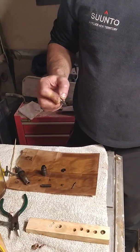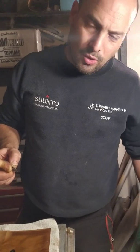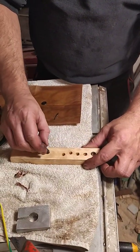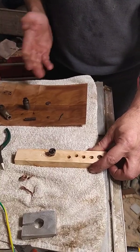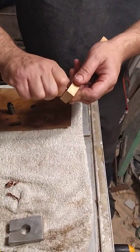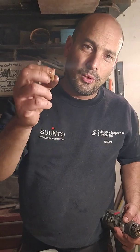The reason I showed you the piece of paper is that you need a 7.5 millimeter hole and an 8 millimeter hole in the wood. With the 8 millimeter hole you can place the nozzle in it and store it while you continue to clean the other parts, and with the 7.5 millimeter hole you can also clean the tip of the injector nozzle.